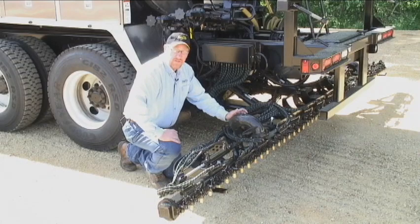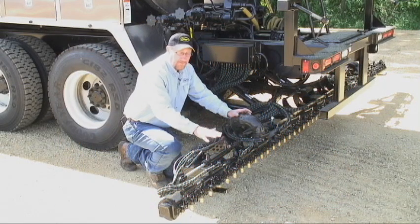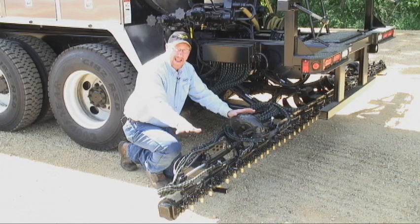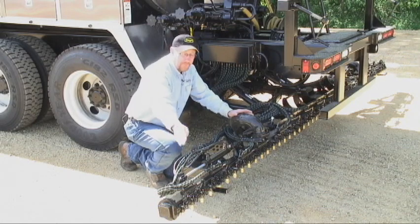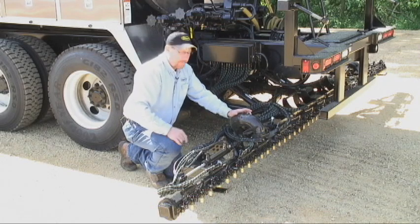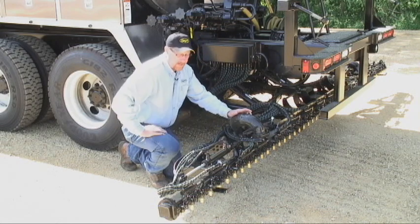Every wing is set up with a safety switch. So if we would raise our wing while we were spraying, or we left our wing up only to spray the center, this safety switch would make the connection so that our wing would not come on and accidentally spray any vehicles. It is the safest procedure, though, if you are going to have a wing up in the air, to physically shut the switches off for every one of these cylinders that you're not using in the cab. That will take the safety switch out of the circuit so we don't have to worry about accidentally making this connection.